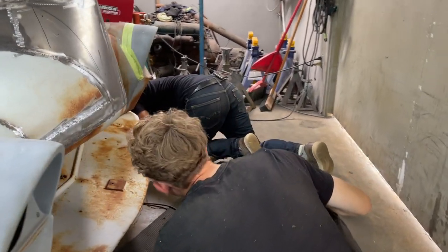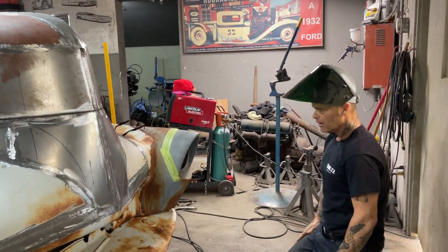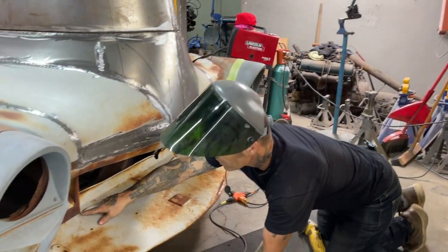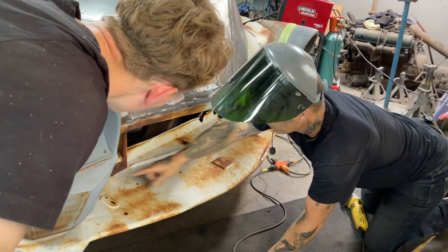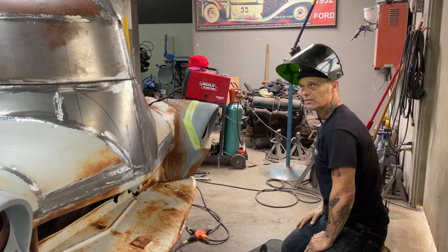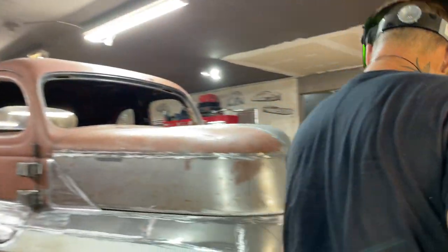We'll get all the bolts in it, and then we'll tighten it up. Okay. Where do I start? I guess when all the bolts are in it, you can start from the center. We'll do that one, then that one, then that one, then that one. That way we just spread it out even. When it gets to the end, we'll have to deal with it, see what happens. Okay, we're on there. I don't think it's going either way, but I'd like to have it on there completely.